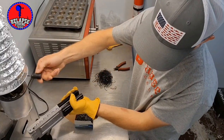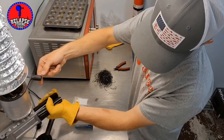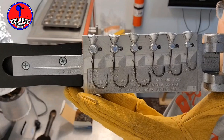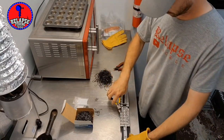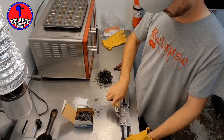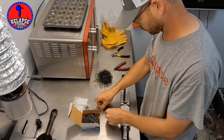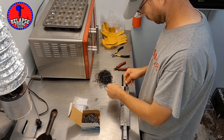I put the mold on top to preheat those hooks a little bit so I get better pours. Sometimes jigs will pour fine cold, but I prefer to let it heat up to make sure I have the best chance at a good pour every time. Once the mold gets really hot it doesn't take much for the hooks to get up to temp, especially with smaller hooks and bait keepers. With bigger hooks you just let them sit a little longer to get a good solid pour every time.